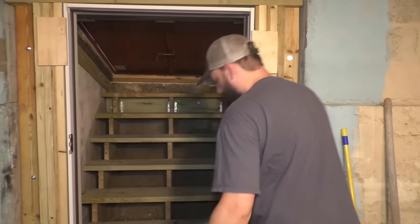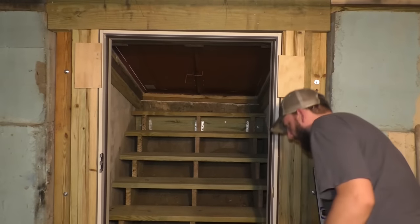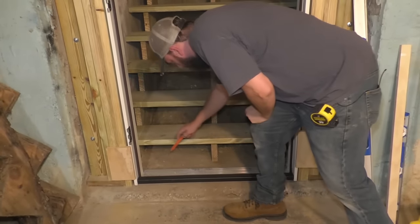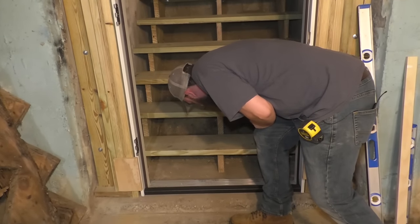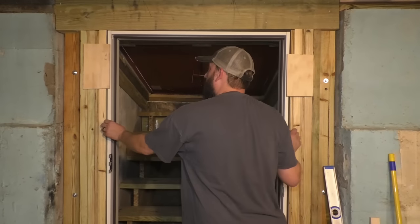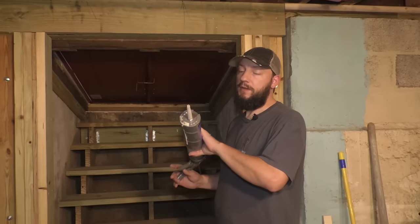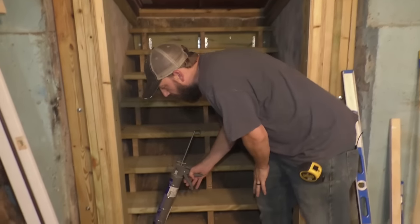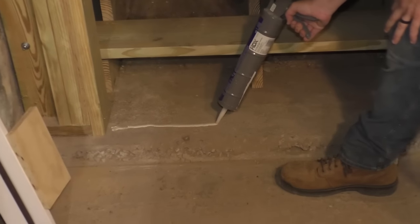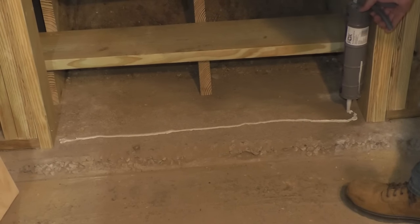The door frame actually looks really great when I just put it in place and get it all plumb. So I really don't need all of this room on either side — what I'm going to do is put a piece of three-quarter inch in here so that I'll have a smaller gap to insulate when I'm done on either side. I'll put this back in place, check it one more time before we say we're good. Plumb level. Now I'm going to take a pencil and mark down here, and then we're going to take this out again. I'm going to use some construction adhesive on the bottom.